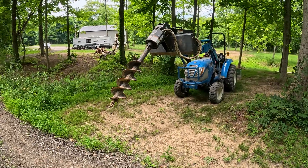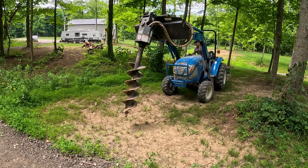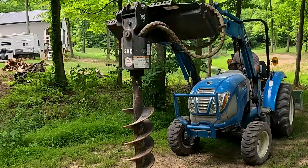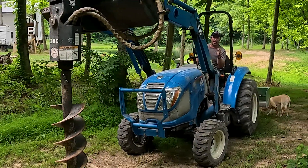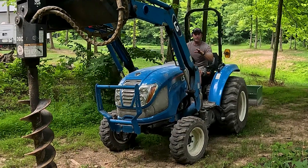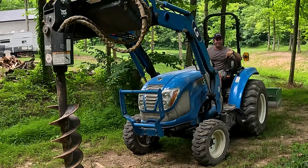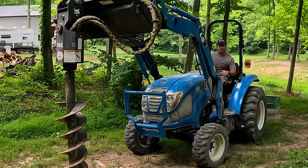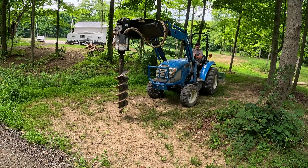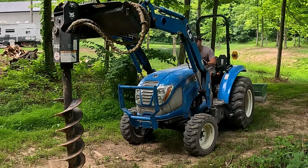This is going to be a good test because I'm back in the woods and it hasn't rained in a long time — the ground should be really, really solid. The benefit of putting this on the front of my tractor is the down pressure. If you use a three-point post hole digger, it only uses the gravity on the auger's own weight. With this I'm able to actually put a little bit of down pressure, especially in really hard soil. Another thing is, with a rear auger those things can screw down and you have to lift them out — sometimes your tractor isn't strong enough. With these front mounted hydraulics I can go in either direction, so I can actually back it out of the hole if I have to. Let's throttle up and see if we can dig.